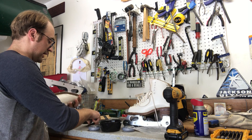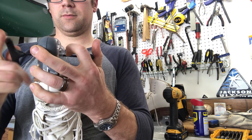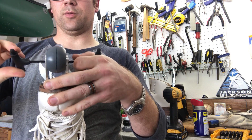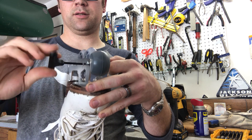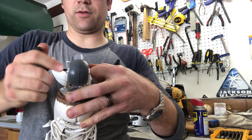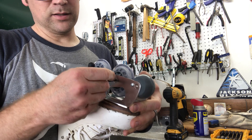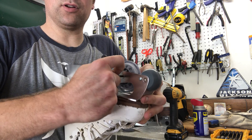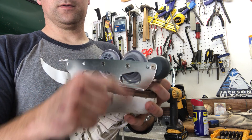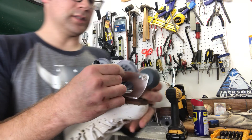We don't want side-to-side wiggle of the wheel. So what we're going to use is our two Allen keys that came with these — we're going to lock it down. You're going to do it snugly, like you would firm. I don't want side-to-side wiggle of the wheel, but I don't want to go so tight that if I really clamp this down, the wheel doesn't really spin. Now just come back a half turn — so it's snug but not so snug that it's not wiggly side to side. It makes a world of difference. You want to balance that out — you don't want the wheel to slip and slide, but you want it to spin freely.